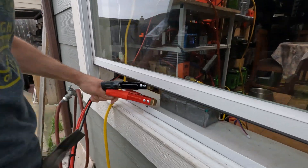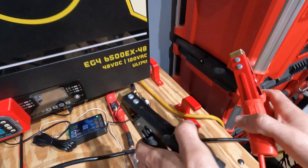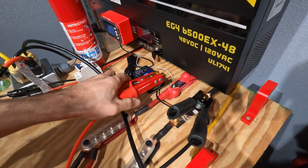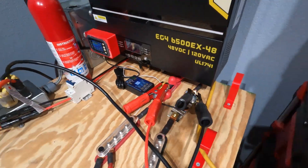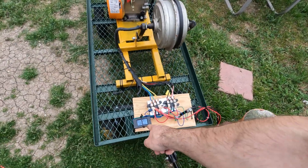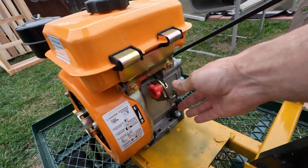Here's my very high-tech pass-through. I want this to read through the current shunt so I need to put it on this side. That's connected - 53 volts. Now in theory, when I start this and get the RPM high enough to produce more than 53 volts, we're going to start charging just above an idle.